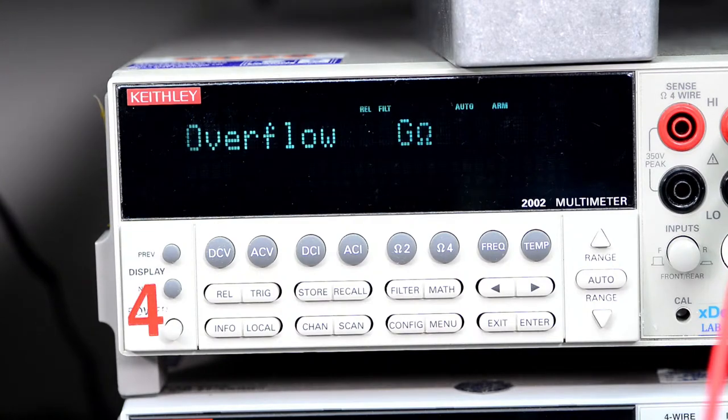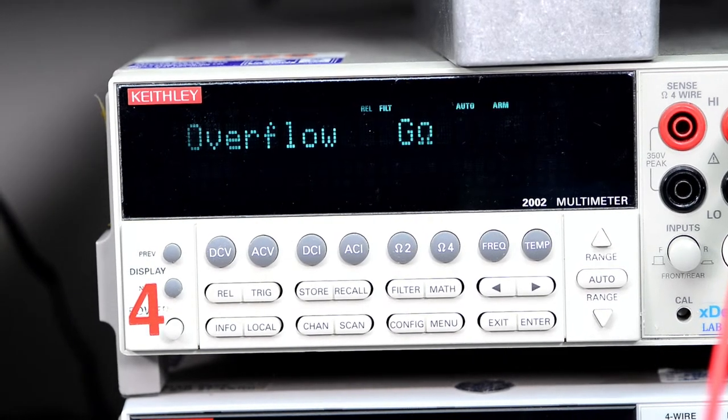So we can check the new resistors as well, just to make sure they're all happy. That's our new 100 ohms. I'd say that's close enough. And this is our 1K. All right. But before I put the new resistors in, I'll need to clean up a little bit the four holes.